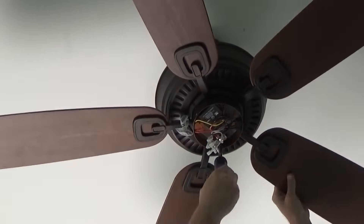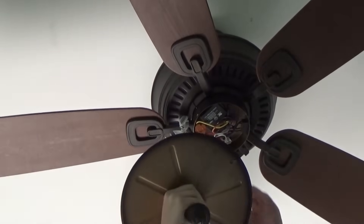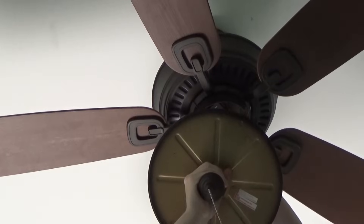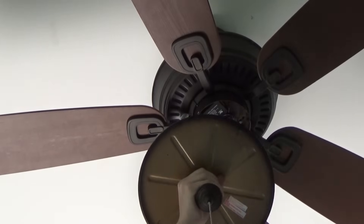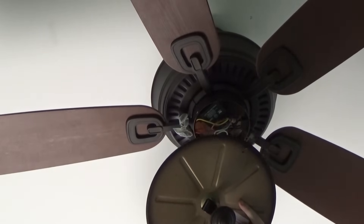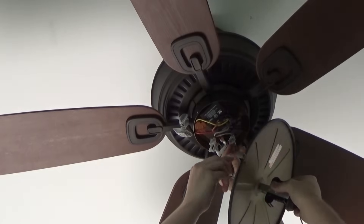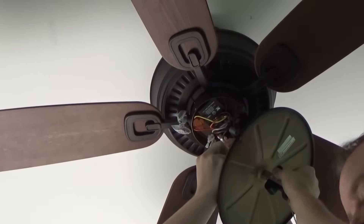Now you have what looks like a ceiling fan, and we're on the home stretch — everything's easy from here on out for the most part. Our next step is attaching the light kit. This particular light kit has two wires you need to connect — thankfully you don't have to use wire nuts. You've got two wires and they're the same color on both sides, so you know which color goes where. You're just going to slip them into the connectors — they have connectors built into both the ceiling fan side and the light kit side. They just slide into each other and snap. It's helpful when you have a helper to hold one side while you snap them in, but this can be done by yourself.